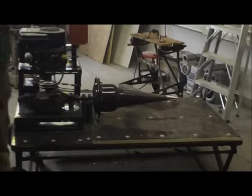And that's that. She works pretty well. Now that I got the bugs worked out of it, she works pretty well. I got that spinning pretty good, just about dead center straight. I also figured out on my own how to sharpen it, and I can't get it to move right now, but what you want to do is take the smallest chainsaw file. I forget what the smallest chainsaw file is, but you want to file right on the inside of that edge, so it's a hook, and it just goes right into the wood. Seems to work really, really good.